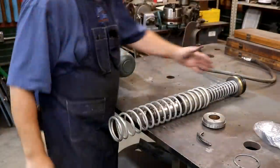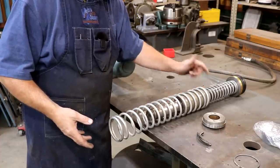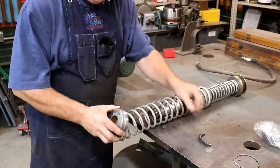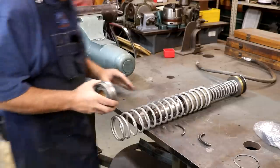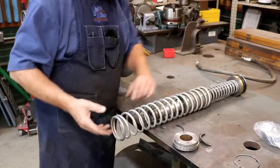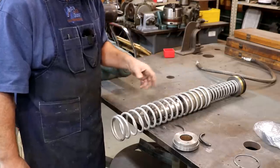Let me show you how the return spring mechanism works. We have the piston up here and the ram that comes down through it. These are two nesting springs — there's a smaller inner spring, a sleeve that fits over the inner spring, and the outer spring fits over that. This all compresses in the tube on the bottom. There's a cap piece and some retaining pieces that hold it all up in the cylinder. When you press, you're compressing the spring; when you release the fluid, the spring returns the piston back up to the top. This eliminates having external springs — all the springs are contained inside the cylinder, which works real nice and tidy.